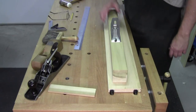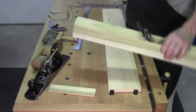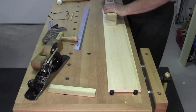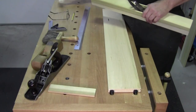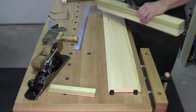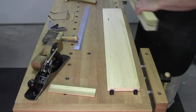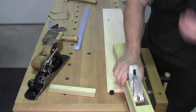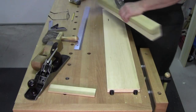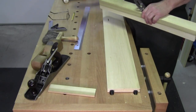So does it work? That's pretty thick. Let's see if we can't lighten that a little bit. Still a little thick — tap-tap. Still just a little thick. Now we're a little light. Tap-tap. You don't get the same fine adjustment like you do on a wooden wedge plane. That's not too bad, but obviously it works.